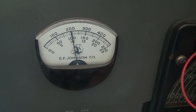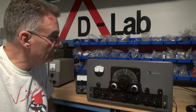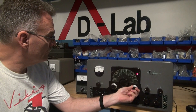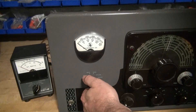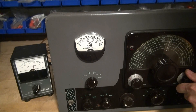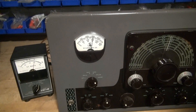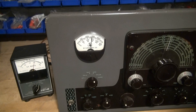Next step - we're going to put this thing in transmit mode. It's test time for the Valiant. I've got it in CW mode on 40 meters - flip the old switch - bam, putting out about 120 watts. Got a good plate dip. Let's go to AM mode and see if she modulates. Now we're in AM, going to grid first - I have a microphone hooked up. There's my grid, there's my plate, there's the modulator current, and there's some modulation. She's talking! The old regulators inside are flashing away. She appears to be working - you can hear my voice coming out of those modulators.